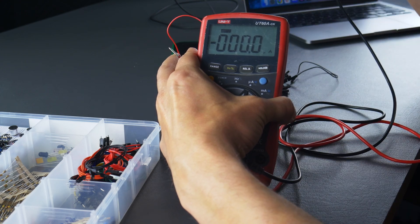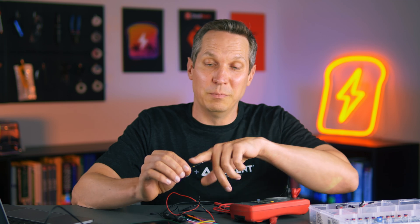Notice how it just dropped? That's because the resistor came out. So again, you're like, why is this zero? Check to make sure that things didn't come out and things weren't terrible. And that's it in regards to our measurements. So we've now measured resistance, we've measured the voltage, and we've measured the current. Then we can just very quickly calculate power: we have 100 microamps and we have one volt. Power is voltage times current — voltage is one volt, current was 100 microamps — so we know the amount of power being dissipated in this resistor was 100 microwatts. I love it when the math is easy.